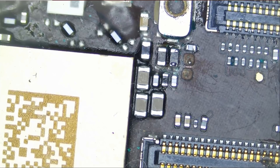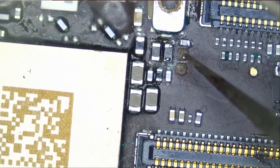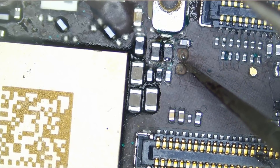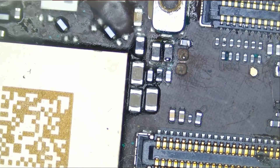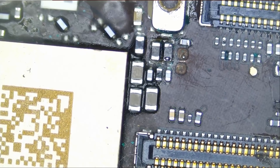The first thing I want to do is mask this exposed ground layer here so the wire does not make a connection with this point and ground — otherwise we're going to have a short. You see how close this exposed ground layer is to the actual pin? Extremely close. I would say maybe half a millimeter. It looks big under the microscope, but this is microscopic. We'll give it a shot — I'm trying to avoid having to run the long wire.